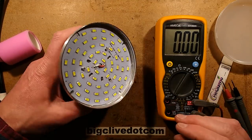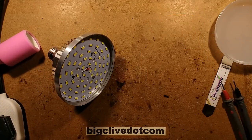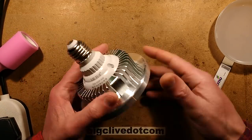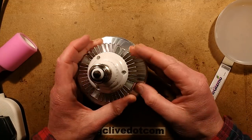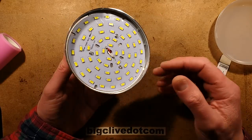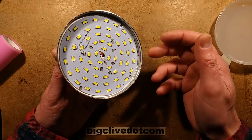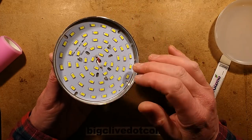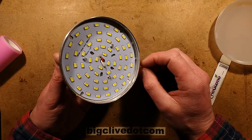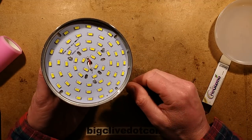Let's put this back from the current setting — as one does, it's always a good idea. Let's see what power supply this has got; I'm kind of impressed so far. Put that to my favourite setting — continuity, it's the one I almost always end up using. It's got this heatsink fin section. This is one of those lamps that seems so wasteful, because when it eventually fails, these LEDs will fail inside. The power rating isn't unreasonable for the large area of the heatsink, and at 190 milliamps across pairs that's about 100 milliamps per chip, which is not really overdriving these LEDs.